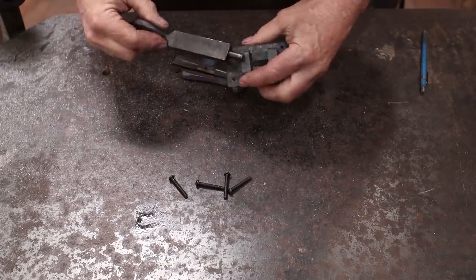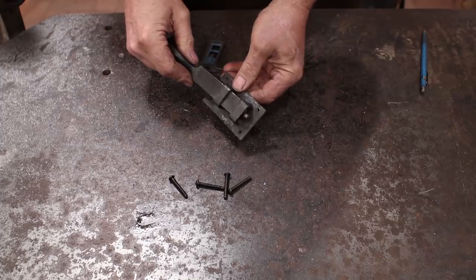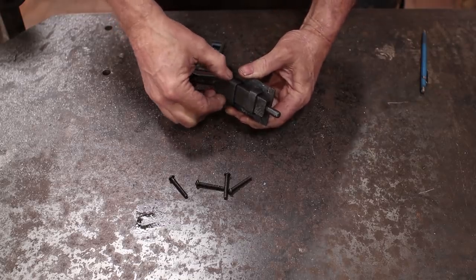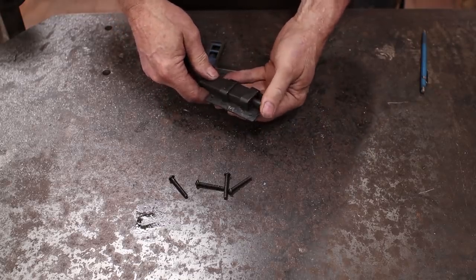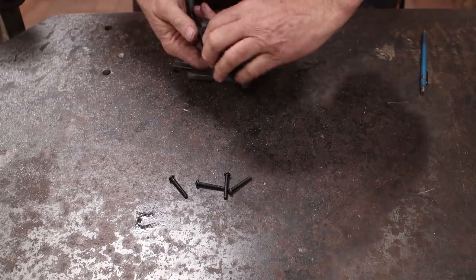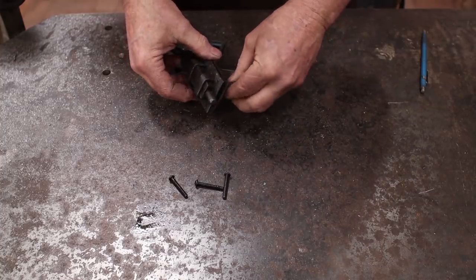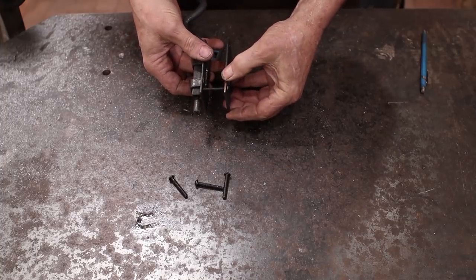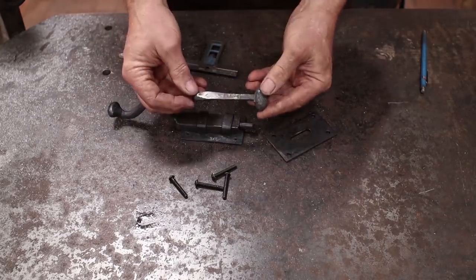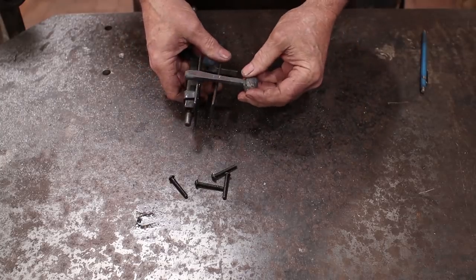So we're getting all of our parts ready to go here. We've got the back plate — I've ground the welds off of it. The bolt slides in there nicely and travels the distance it needs to. It does hang up here because there's a fat spot, but it doesn't need to slide any further than that, so that's okay. The back plate will screw on right there, screws will go through here, and that will trap the door between the back plate and the front plate. So the next thing we need is this, and that has to go through this slot into the bolt.